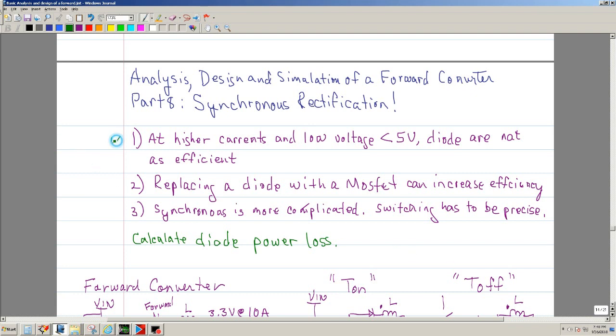Okay, so here's a statement that I want to make: at higher currents and low voltage, less than 5 volts, diodes are not as efficient. I kind of calculated that, a quick calculation. Another statement is that if you replace the diodes with the MOSFET, you can increase efficiency. Normally that's true, but you have to make sure that the power that it takes to drive the MOSFETs does not exceed the power that you're saving from the diode losses. That's very important, so we're going to check on that, maybe on this video or the next video.